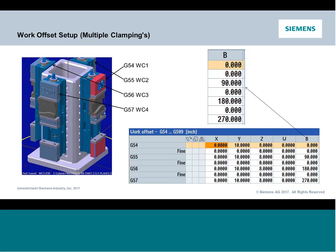But the distance between each of those surfaces is going to be a full 90 degrees if it's 4-sided. Obviously, if you're doing something more compounded, or if you had a 5-sided tombstone, then the angle will be different. But in a traditional 4-sided tombstone scenario, you're going to have 90 degrees between each move. So if your tombstone's out 2 degrees, well, maybe it's 92 degrees and 182 degrees. The distance included is still, again, only 90 degrees. So that's how you're really going to set it up.